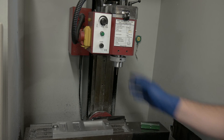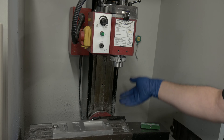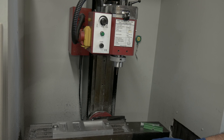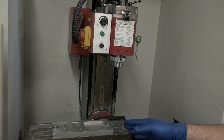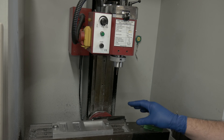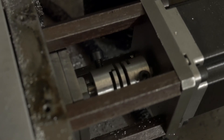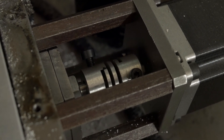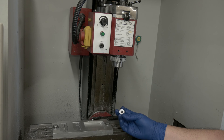So it's a little bit different than a lot of the retrofits I see out there. Some of the retrofits I see, they actually have a Z-axis screw going down the side. This one is actually integrated into the column. The only problem we've ever had with it was the coupling between the motors and the lead screw. There must be some misalignment, and I've looked at it several times and haven't been able to really figure out what the problem is.